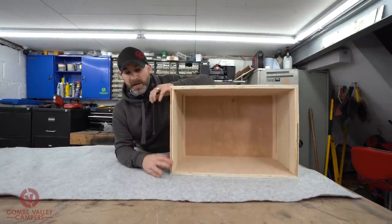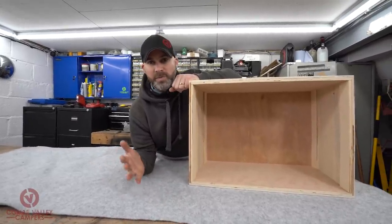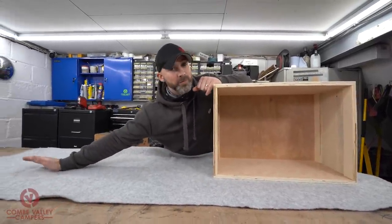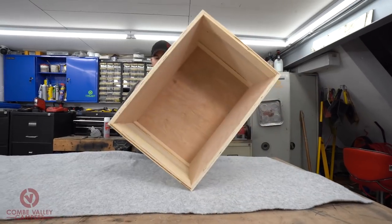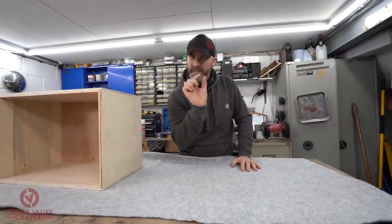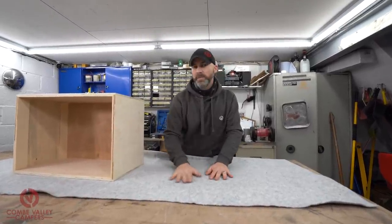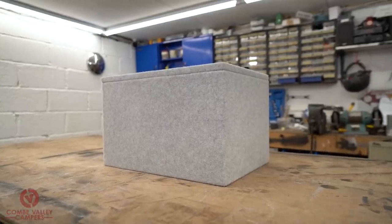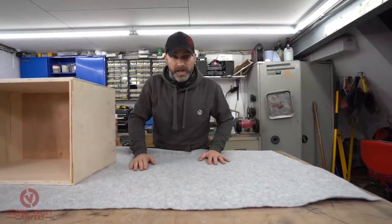The first thing you need to do is measure up your area or at least lay out the carpet over the piece of furniture. I've laid out the carpet — the roll width is about two meters — and I've spaced out and turned the box until I've measured that it fits. It's just a little bit short, but because it's four-way stretch I can just stretch it out a little bit as I apply it, and it will reach that end and make a beautifully neat finish without having to cut a big chunk from a long edge.